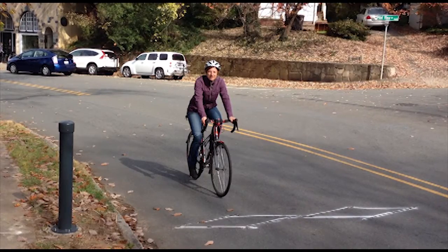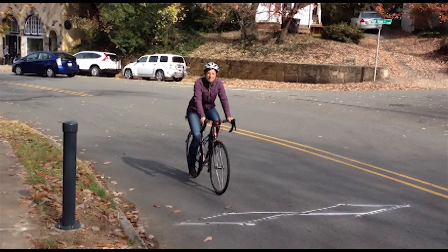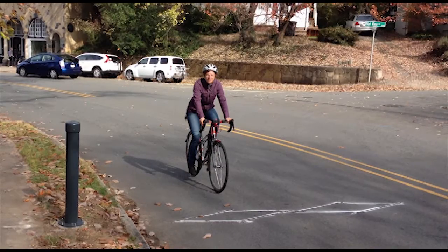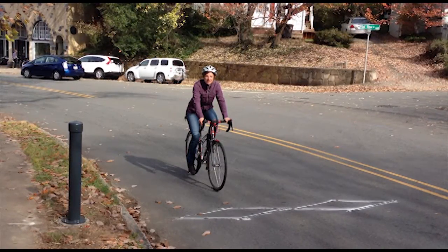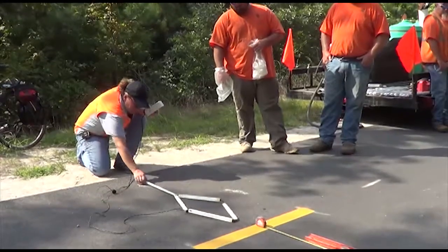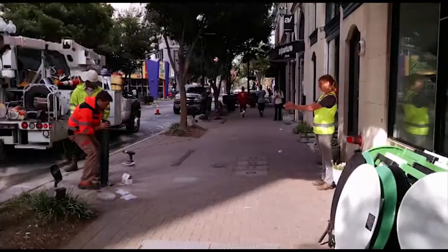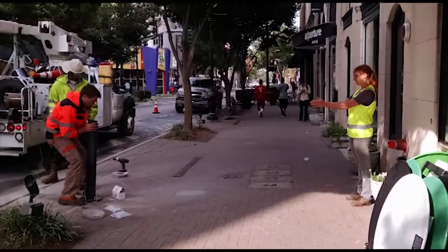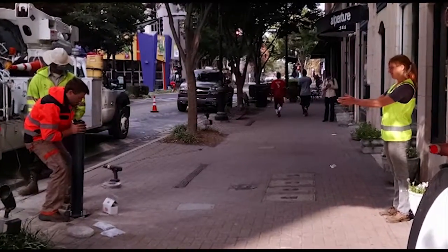In the North Carolina program, both pedestrians and cyclists are detected. This image shows an infrared sensor mounted in a post on the left, installed to detect pedestrians, and an inductive loop on the right, which are installed to detect cyclists. An interference tester is used to determine exact loop placement. The post location is selected based on the distance to the inductive loops and an ideal place where the infrared beam can be oriented to detect pedestrians.